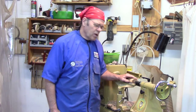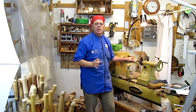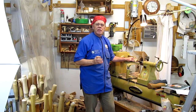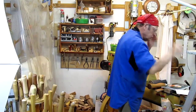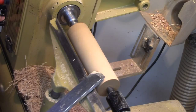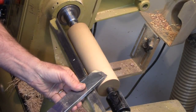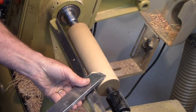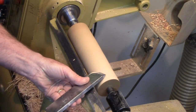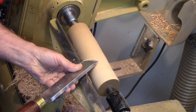The second concept I want to cover is ride the bevel. Bonnie Klein does a lot of instruction with younger turners, and she coined the mnemonic phrase: Anchor, Bevel, Cut — our ABCs. First, put your tool on the tool rest. Put it on the wood with the heel riding on the bevel, and then lift your handle until the cutting edge starts engaging. Anchor, bevel, cut.